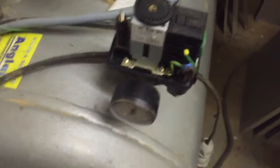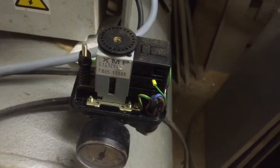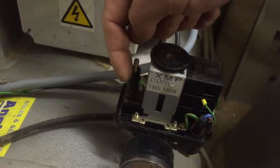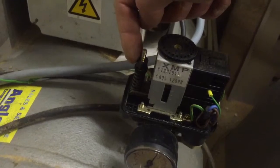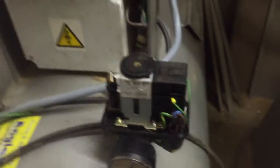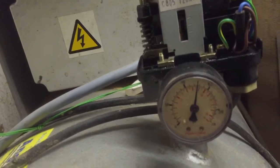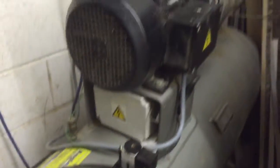I've set the pressure — it's giving me 150 PSI at the moment, set on this dial. This nut here is how you adjust the differential, so I'm taking it down to start up again at about 110 PSI. I always need at least 100 PSI — at the moment we're reading 125.